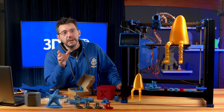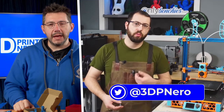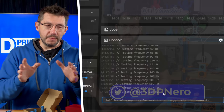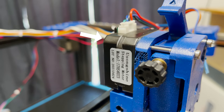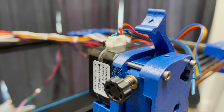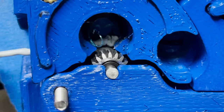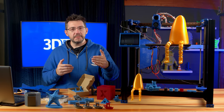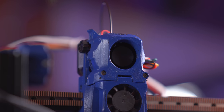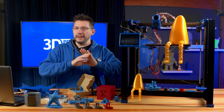I want to give a huge shout out to Nero 3D — he is my Klipper muse and a wonderful human. He helped me with a lot of this because some of the issues we ran into were configuration-based. As an example, this stepper motor for the extruder was running at one amp, which caused it to heat up enough to transfer heat and cause a jam. I talked to him over Twitter DM, and he understood the problem. He gave me some things to check, and we took the amperage down to 0.7 amp. It still gets warm but it's not hot, and it doesn't transfer the heat — we're all good there.